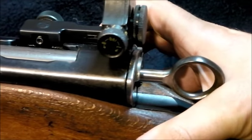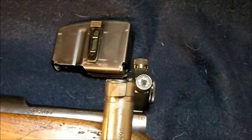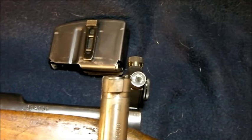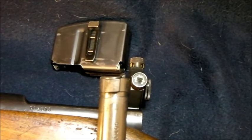Let's just put it forward and do it again. See how it comes back? Now how this is achieved is very simple — the bolt lugs, as you can see, are just cut at a slight angle so that as the bolt body turns it withdraws ever so slightly.